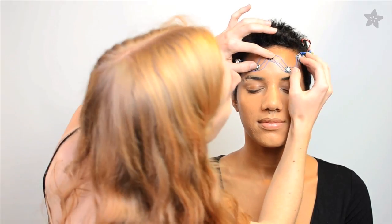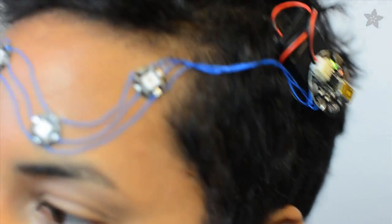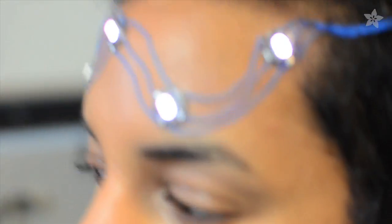If you've never used this stuff before, test it to make sure you're not allergic. When the latex is dry, flip on the power switch and watch your pixels glow. You should feel very comfortable with no noticeable prickly feeling when the power's on. If you're getting a tickle from any of the pixels, go back and insulate it with more glue.